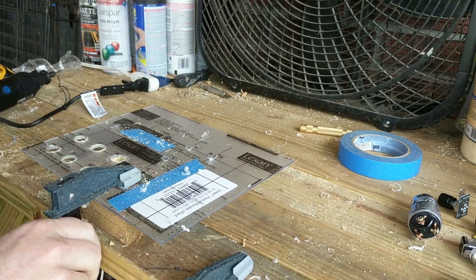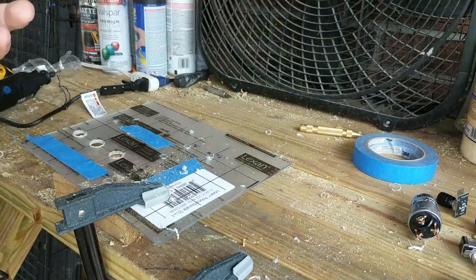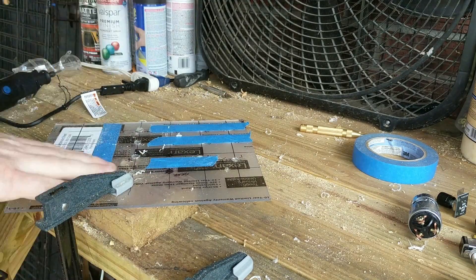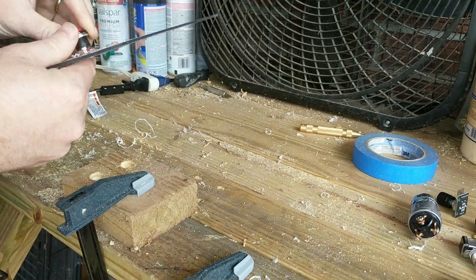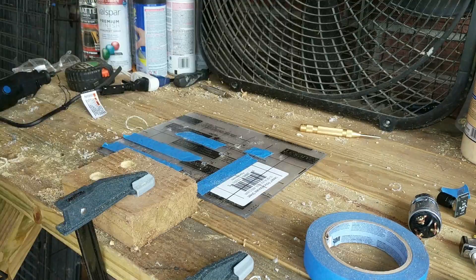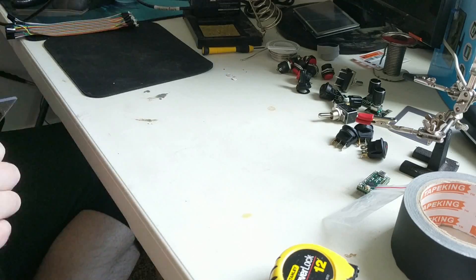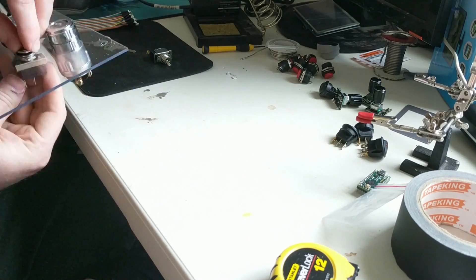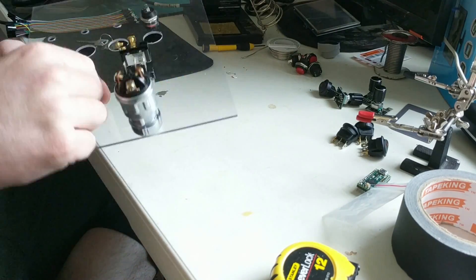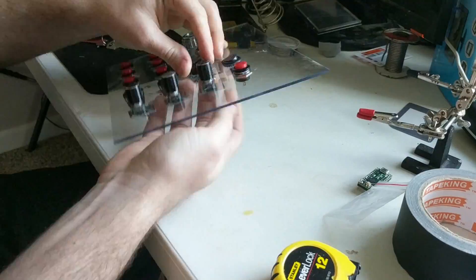Using one of these stepped drill bits, I drilled out the holes to the sizes I had marked. Conceivably this kind of drill bit could have been used to drill every hole, but if I had a drill bit that was the right size for a given part I used that instead. There are a lot of holes on the board with a lot of different sizes. Once a hole was the right size I used a piece of tape to cover it, indicating that I should leave that one alone — this helped me avoid mistakes. Once the holes were all the right size I test fit all of the pieces, noting if any holes needed to be enlarged. It's helpful to have the holes just a tiny bit oversized since the vinyl covering can interfere with the hole clearance.